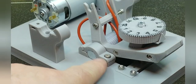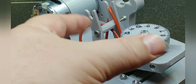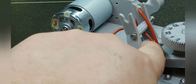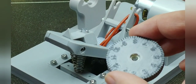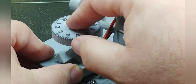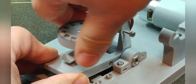The only time you need to take this apart is if you break a band or think one is about to break — take the clamps off, remove the knob, and the whole assembly will come out. You'll only need to remove the barrel pulley and stiffener to put new bands on. Next, go ahead and put on the indicator: push the assembly down and get it started — it's a lock nut so it'll take some effort, and it will wear itself looser as you use the machine.